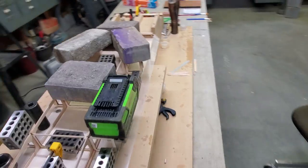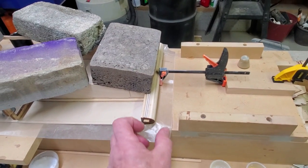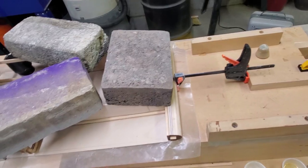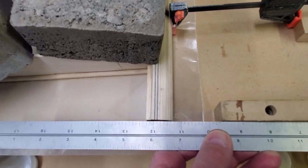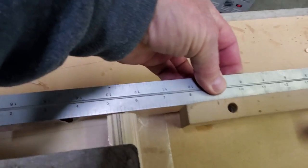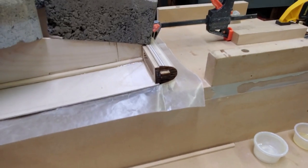My heights here are perfect, but now what about the position of this bullnose? It can squirt around — it can actually squirm side to side; nothing is holding it in position except the pressure. So to align that, I've simply put a straight edge on there — a popsicle stick works right for mine — to check that clearance side to side. Okay, so it's centered up. You'll find, if you haven't noticed already, you'll have a 1/16-inch overhang on your floor — you should, if you don't, something's wrong.